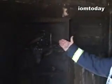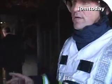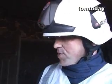The videotapes from before — that was not melted from there, that's melted from the fire coming up and over. If I put my hands up, I can still feel a great amount of heat in there. That ceiling is meant to be a half-hour ceiling, but unfortunately it would last less than 10 minutes in a fire of that severity. This is not a typical house fire — if it were, we would not have actively fought it in five minutes, because we were on scene with sprinklers ready and BA crews under air with hose reels ready to react. If this had been a proper fire with people upstairs, smoke was issued not only from the lower windows but from the upstairs windows and through the tiles — the smoke had gone completely throughout the house. Survivability in this room would have been nil, and anyone upstairs would likely not have got out or would have had to be rescued.